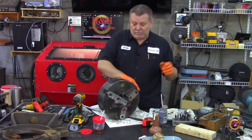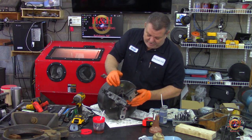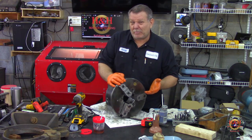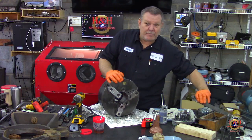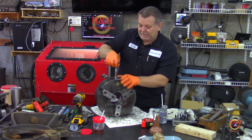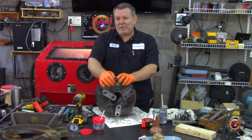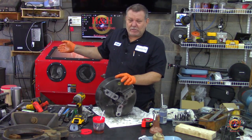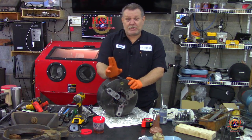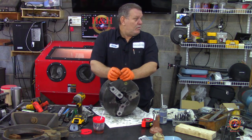Super happy — super, super happy! Compared to what this thing looked like versus what it is now — incredible. This was my first big lathe I've ever owned, so I've never taken a chuck apart before. I have to thank fellow YouTubers who post their content because without that I wouldn't have known how to do it. The jaws have zero wear — of course they're replaceable jaws, so they may have been replaced. But the insides show no wear marks at all. It spins really good — one finger, no effort. We'll get it oiled down really good and set it onto the lathe. I still think I'll take it apart one more time for a really thorough cleaning, since when I ran the jaws in it came out black — it should have come out clear oil.